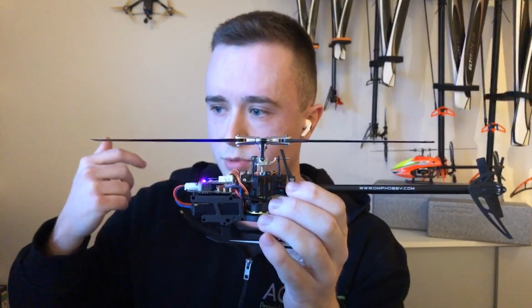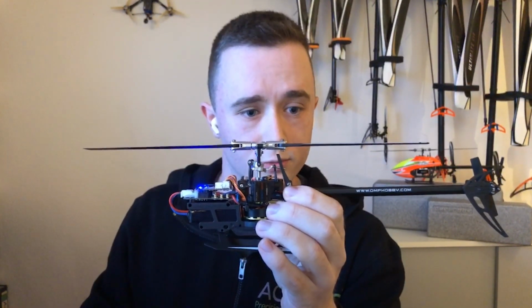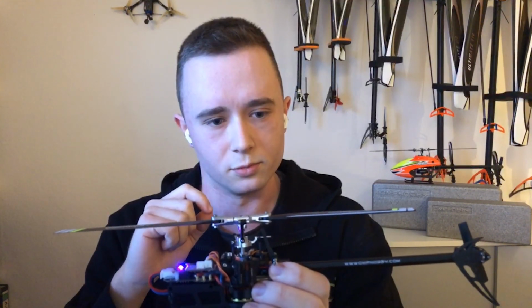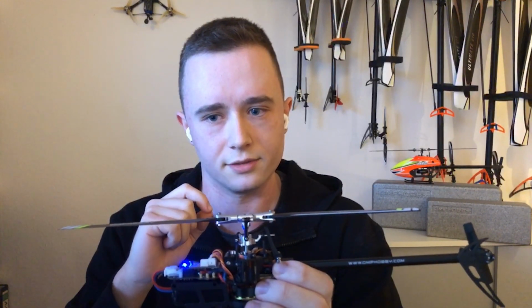On agile 1, which is probably the lowest, you get the least feed forward directly from the stick to the swash. On 9, it's the most. And the goal of feed forward on a flybarless unit is to give it just the right amount, so the helicopter would reach the rotation rate that you request without the gyros having to do much.